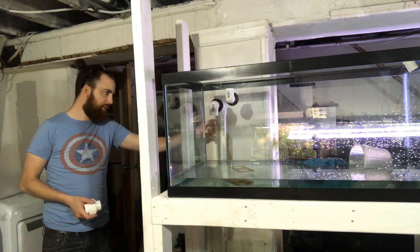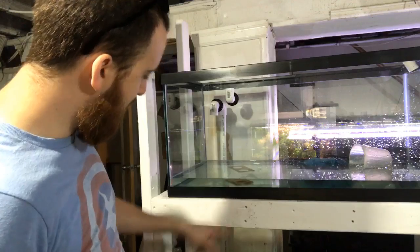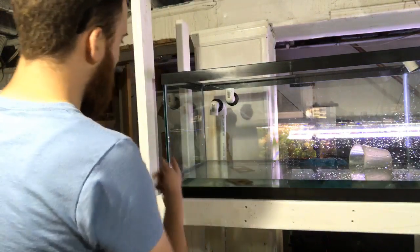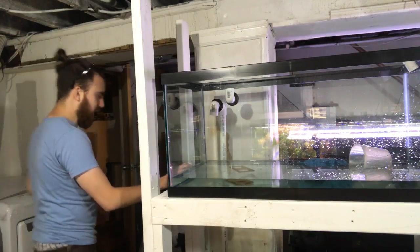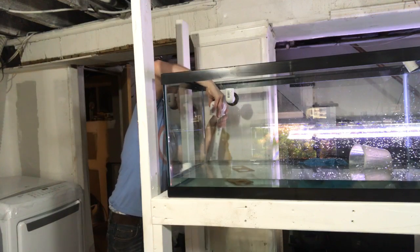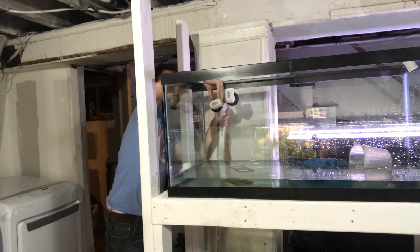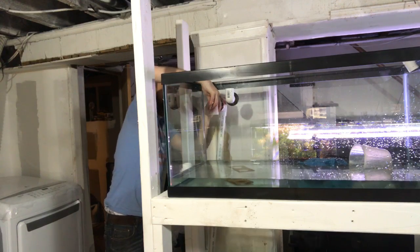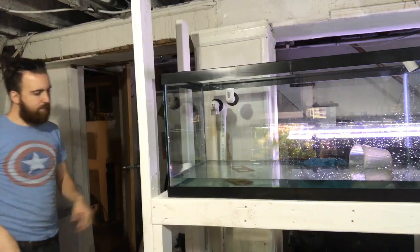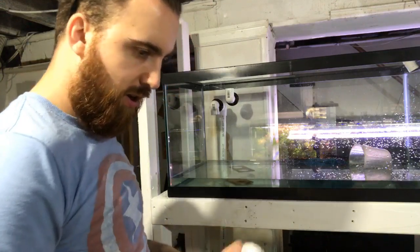Oh no, but if I want to remove, no, I do have to, I'm going to put one at the top. Because if I don't put this at the top, then in order to get that piece of PVC completely out of there, either I have to cut it, or I have to unscrew the whole thing, and I can't unscrew it that way. I could maybe unscrew the bulkhead. Would that work? I guess I could unscrew the bulkhead. So I guess I'll just do one union down at the bottom, for allowing me to swivel the output.